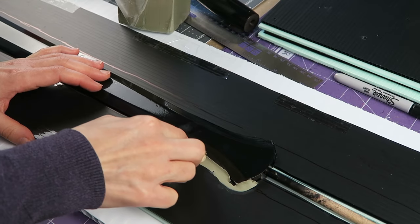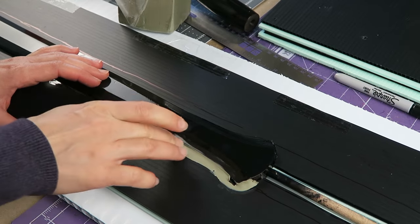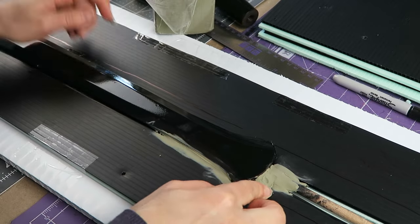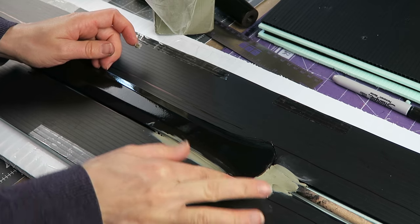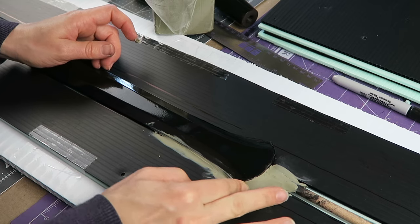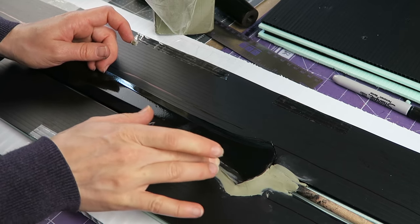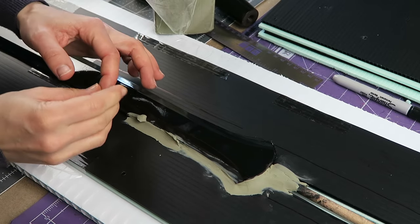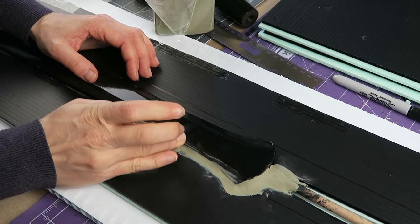So I'm using a mix of foam and corrugated plastic. This model does have a blunted blade, which I want to go ahead and make that a sharp blade. So I'm using clay in addition to recessing the part deep into the flange. So I'm just going to build that up and create a sharpened edge and ensure that the resin isn't going to seep under and that the mold will release.